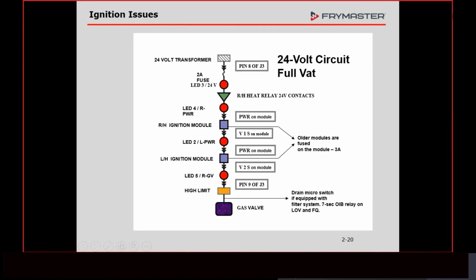Let's say I come in and go over to the flame sensor wire down at the igniter. I've got the computer drop down and I'm looking at the module. I'm down at the igniter and I see that little white wire there. I walk in to filter the fryer, I grab that wire by accident, and I pull the wire out of the spade terminal. It was running just fine. When I pull that wire out, that signal goes away.